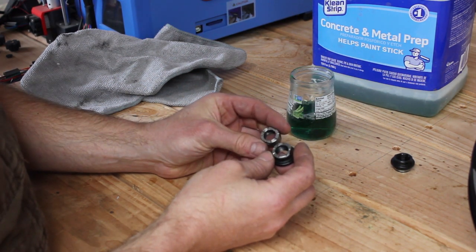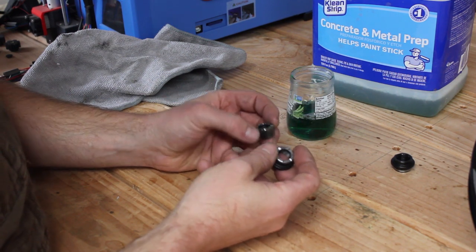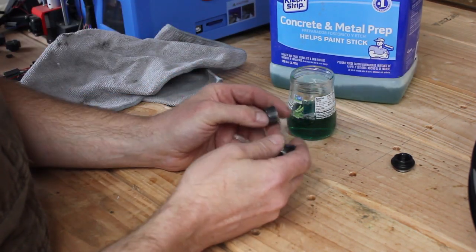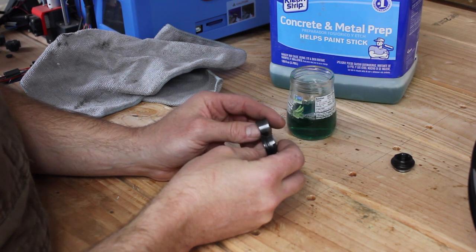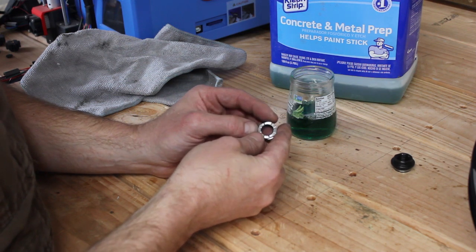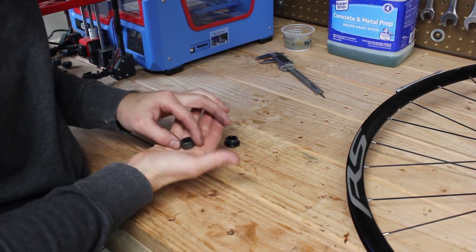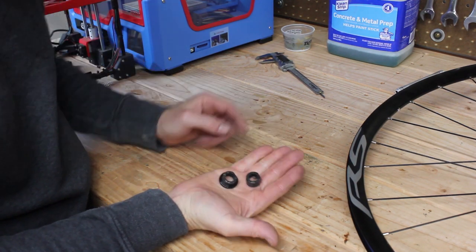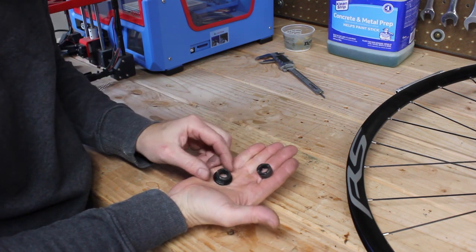To give these a finish — they were originally probably phosphate coated or black oxide — I'm going to give them a phosphate coating. I'm going to soak them in phosphoric acid for about an hour or an hour and a half until I develop a phosphate coating, then spray them down with oil and let the end caps sit in acid for about an hour. I pulled them out and wiped them down with oil. The coating is not particularly thick, but I think it'll do all right.